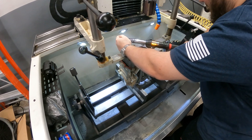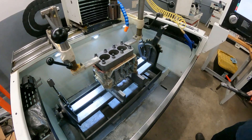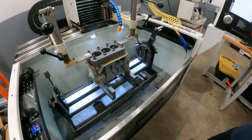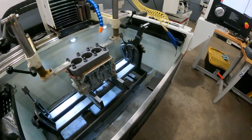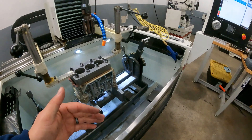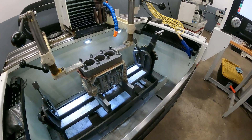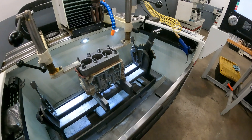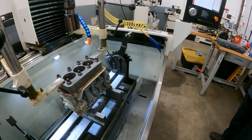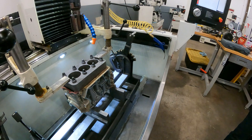ARP came a long way with this stud and the thread profile. This block isn't the nicest, but it's really tight on the way in — not loose at all. So now at 80 foot-pounds, we're at what most people torque their 11mm studs to, which is roughly 11,000 pounds of clamp load. Our Mitsubishi stuff that we run 90 pounds of boost on is torqued to 100 foot-pounds. With the 4G heads, if you went above about 95 foot-pounds it would just crush the columns down — even with shoulder washers you could get to about 110 before things got wonky.